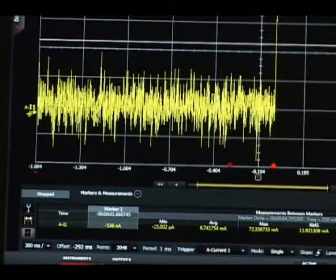This is a close-up of the waveform at the first spike using the fixed measurement range of 100 milliamps. As you can see, we have a peak-to-peak of over 20 microamps. Since we're expecting a standby current right before the spike to be in the range of 5 microamps or less, this fixed-range measurement presents an accuracy offset that is not acceptable.